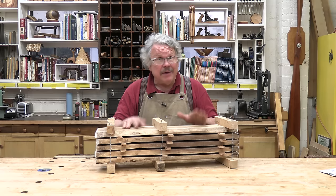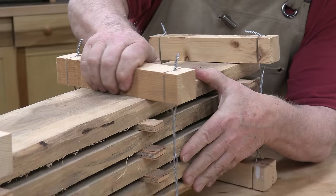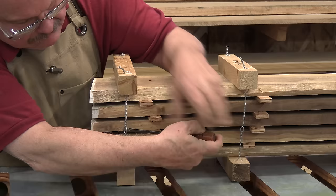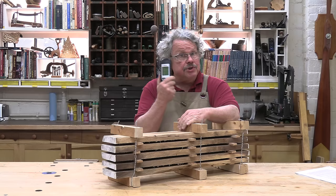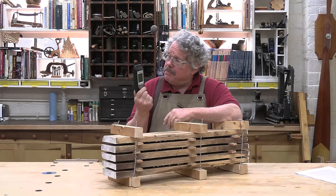After a year, this is still sitting flat on the workbench. You do, however, have to monitor these wires. As the wood dries and shrinks, the wires get loose. I had to give them a few extra turns twice during the drying process to keep the pressure where it needed to be. I've never had a problem with air dried lumber as long as I followed the simple rule of thumb: always let it dry one year per inch of thickness. But I bought this moisture meter so I could look serious about this stuff.